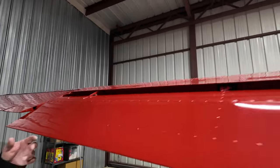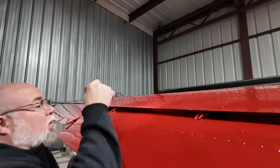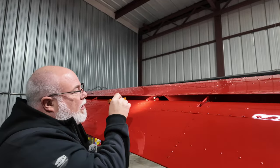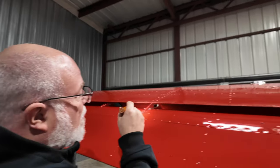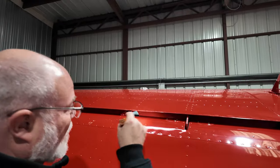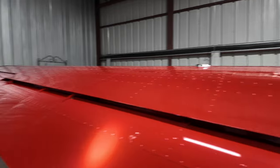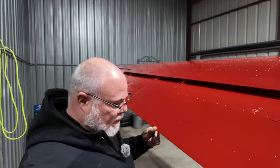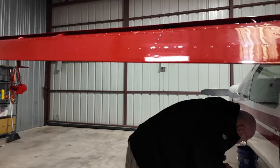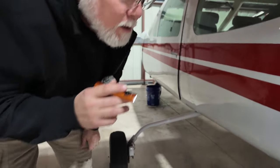Onto our flap. Flap we can see, so we're looking for the lock nut. Here's the actual push rod. Has some play in it. Good there, the track's installed. Another safety nut, or lock nut, and a track. Should have a little bit of movement and not much slop side to side. I already checked the tire earlier, but since we're here, we can look at that. No leaks. Tire's got pressure coming down the side.